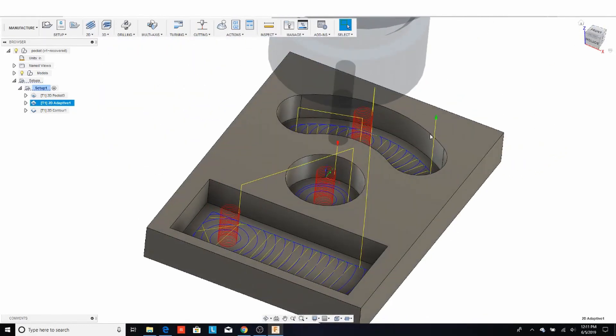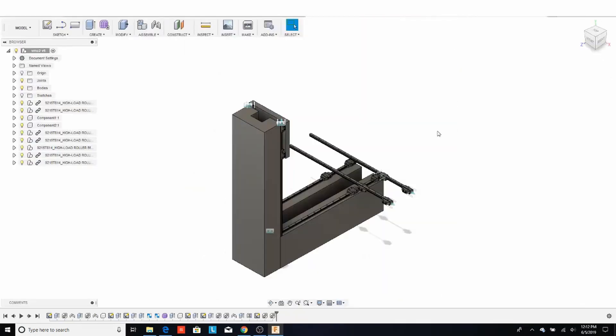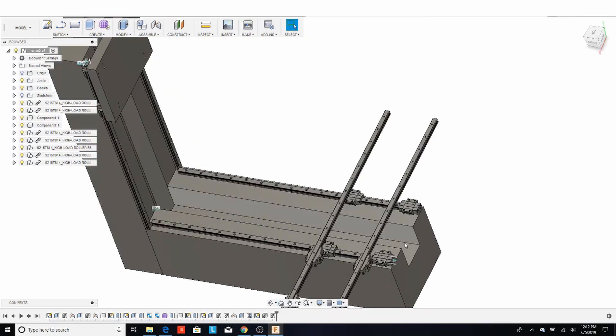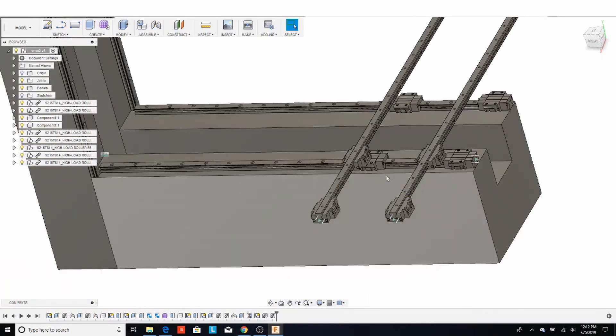Adaptive works pretty well and works better in modern machines than older machines. With modern machines, they don't like long linear cuts on one axis, and the reason is — this is a mock-up of a CNC mill — these machines use linear rails. Linear rails are really fast and don't wear out much because they've got roller pins packed inside their housings.